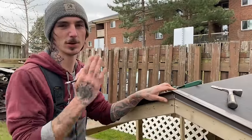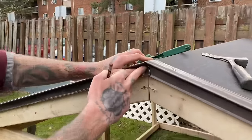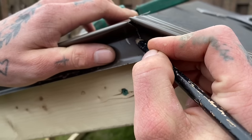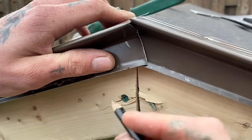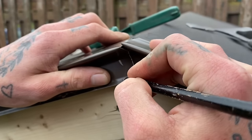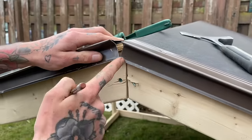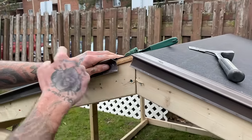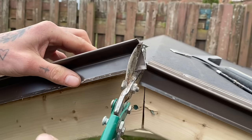To cut that piece vertical with your ridge line, you're going to take a pencil, find where the top of your cut is going to be, then come down to where your truss ties in — that'll be your straight cut right there. This piece will be your closing piece that'll be behind it; this will be your finish and that's the protection behind it. It's marked out, so you're going to go ahead and cut it off.